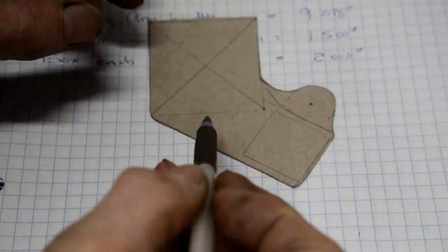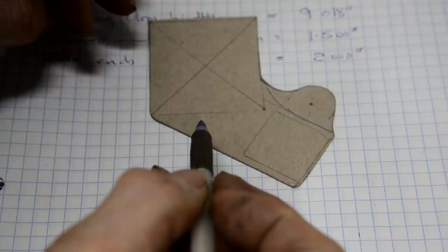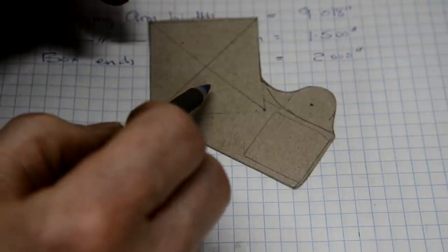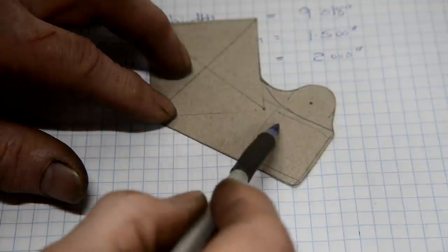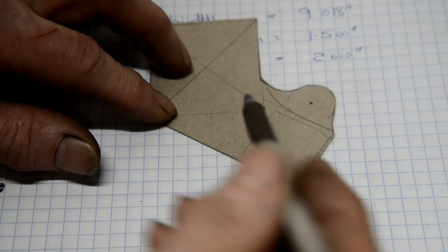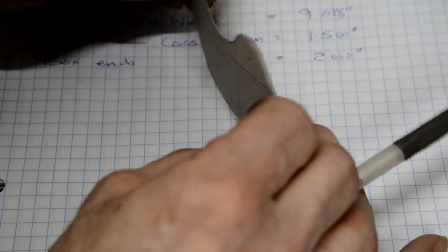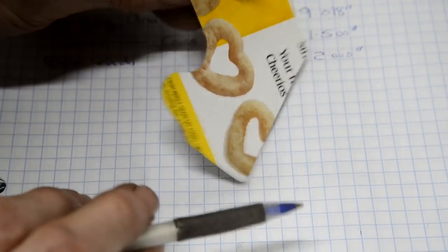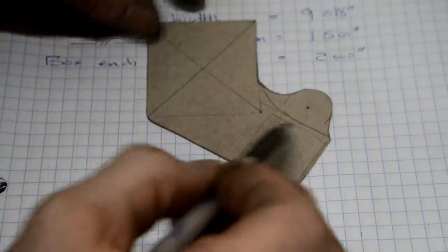Now the other thing is, I'm making the box out of, I think it's 3/16, and it's 4130. But I'm going to make the ends out of 1/4 inch. That's because in the past, when I've made these, particularly when they're not part of a great big box, you'll find a pressure on the footrests, particularly if you keep running into rocks, as some of us are prone to do, will bend this. It'll bend it back like that. In fact, on my BSA, on the backside, I welded some strengthening ribs, and I may even do that here. So I decided quarter was the best.